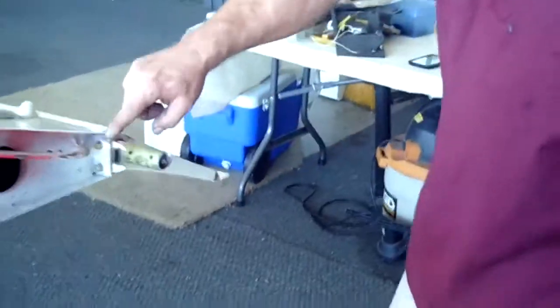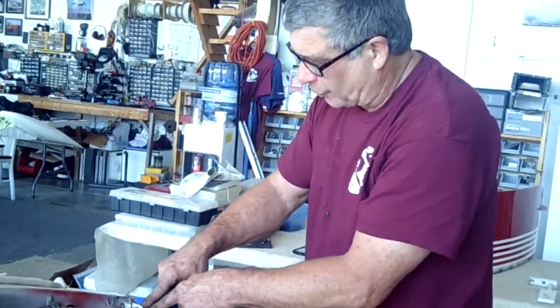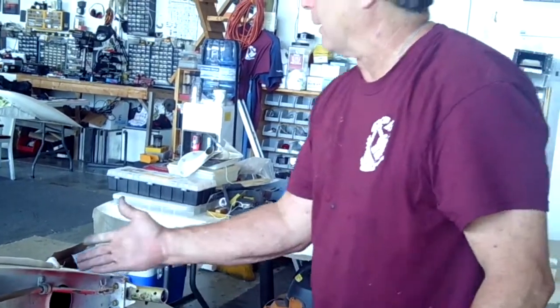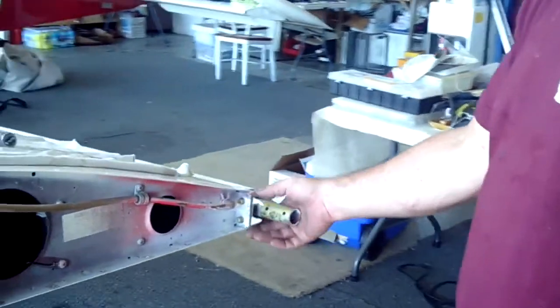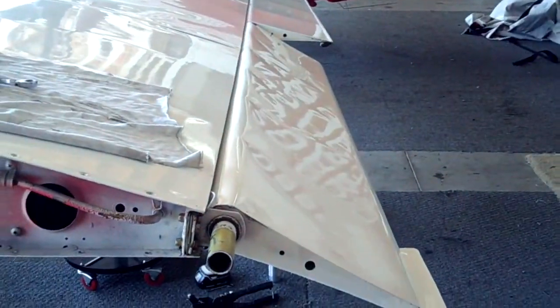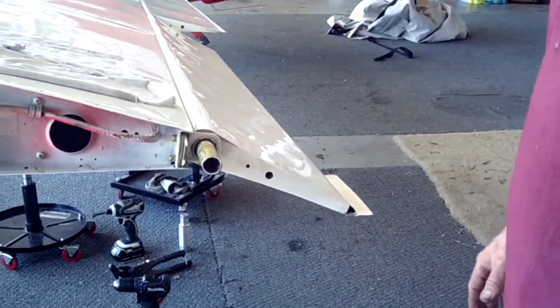Anyway, that's the correct stack. You always want the aileron stop bracket to be closest to the torque tube, followed by the bearing bracket, and then whatever shims you need to make it line up even at the back of the wing root. We hope you found this informative — take a look at yours next time you have your wing tip off, and have a good day flying your Grumman. Thanks for watching.